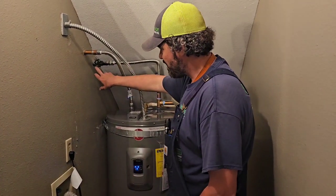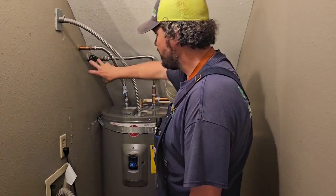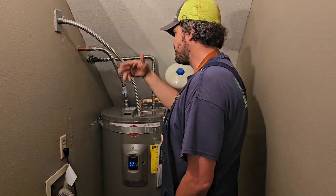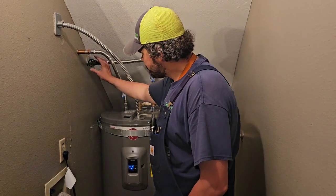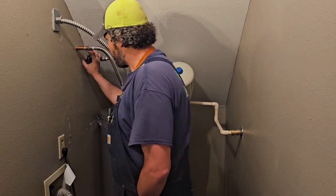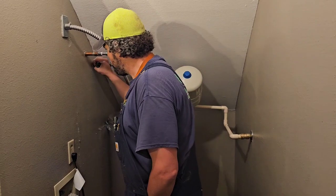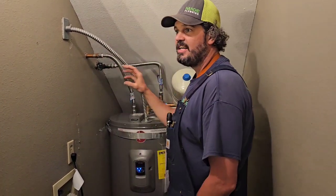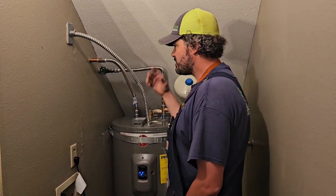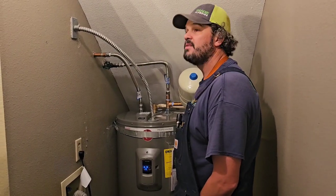So this is called a gate valve in lieu of a quarter turn valve. This is a gate valve, so it's a lot of cranks. It's like 12 quarter cranks to the right, righty tighty, so righty closey, lefty opening type of thing. Yours is missing a handle here, but it's fine. I have it in all the way on position, so let's go all the way on, so that's all the way to the left, and then back a little bit. That's what I was telling you about it not sticking, because if you go all the way to the left and leave it, and it's like that for the next 10 years, that's going to be a really sticky valve when you go to operate it next time. Same with the one in the garage? Yeah, same with the one in the garage.